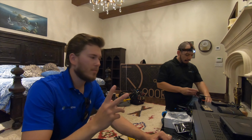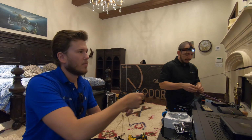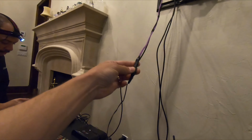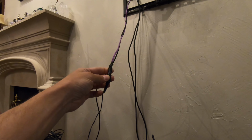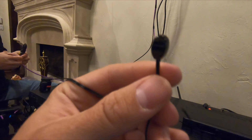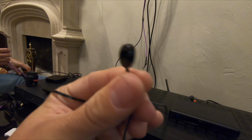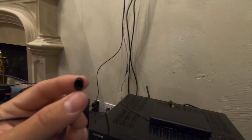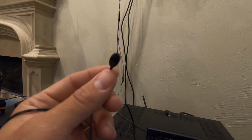Okay guys, so a couple things. You can see Frank has already gotten our cable spliced in here. This is for IR control. On one end, we're going to have an IR sensor. We're using the Pro Control Pro24R and the Pro Link R, which will allow us to control the TV without the customer having to point the remote. So say they're laid back in bed, they don't have to worry about the pillow being in the way.